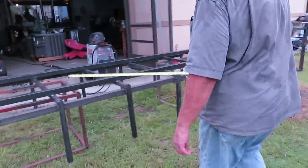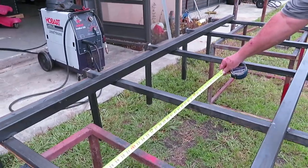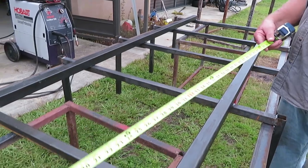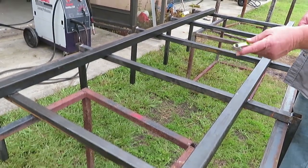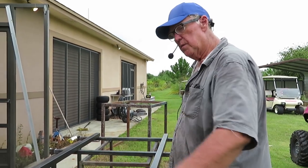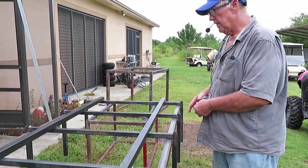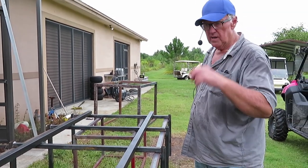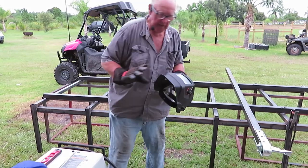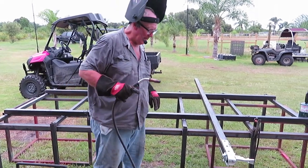So I'll just go 4 feet - we're going to cut a 2-inch by 2-inch channel. From beam to beam is 48 inches, so I'm going to go 48 inches plus another 48 inches, which is 8 feet. I'm going to put a 2-inch receiver on it - everything I have is 2-inch, I don't use 1 and 7/8 at all. So this is going to be a 2-inch receiver to hook up to the trailer hitch. I need an 8-foot 2x2, and I'm going to cut one end and put the receiver on it.